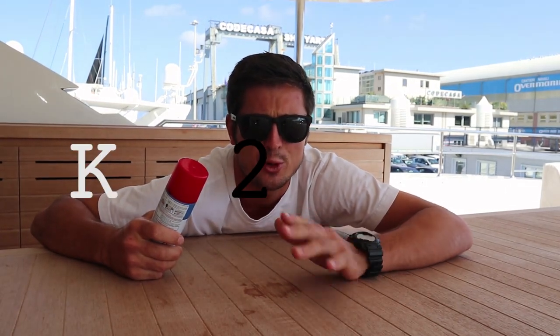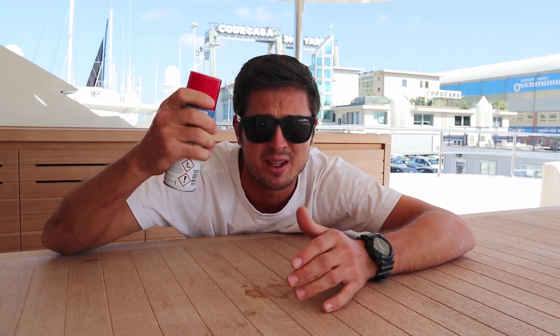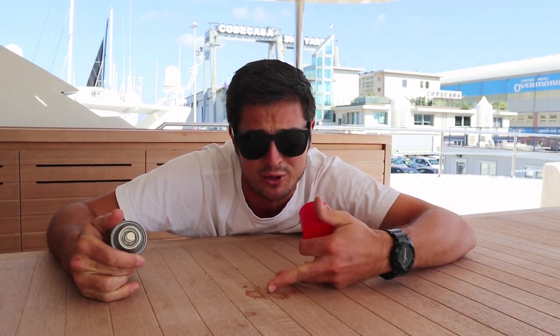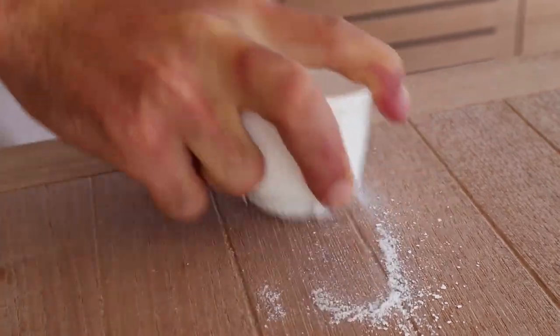There's a product on the market called K2R — a very well-known product that pretty much any super yacht dealing in teak is going to have on board. This is a wannabe version of it because we couldn't actually get the proper K2R, but you can buy this in most marketplaces or main stores. If you're in a rush and don't have time to clean all the teak, this is a fast way of doing it. That's pretty much gotten rid of that mark, but there's no way I can do that on every single oil mark. So the fast way is to wet down everything and use what we have on board, which is Elena — literally just dishwashing powder or washing machine powder. You sprinkle it on, use a doodle bug, and scrub against the grain.